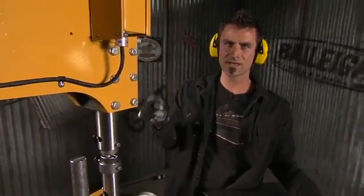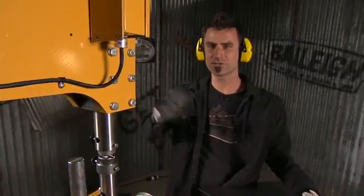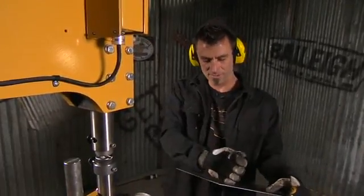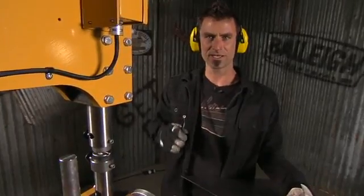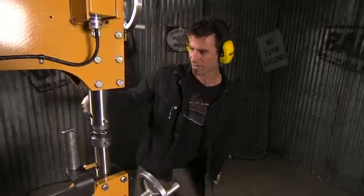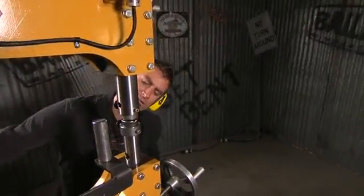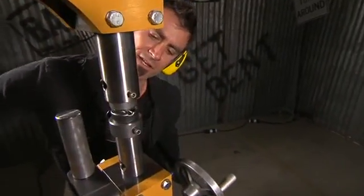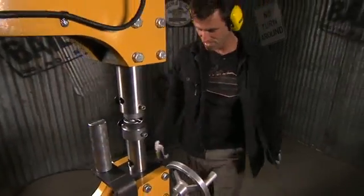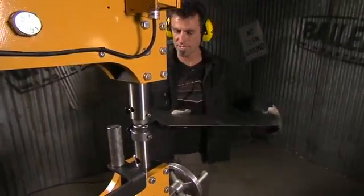You want a lot of little bitty ones to try to make it nice and smooth. And we locked it into rigid mode, so we're not using that spring anymore — now we're using a rigid block. That way when we come in and make that line, it'll be nice and smooth and hard. We check our height so we can see how we're looking. We've got a metal thickness in there, and we do that by spinning it around via the wheel on the opposite side. At that point, we're ready to rock.